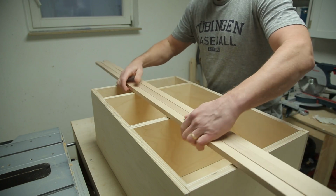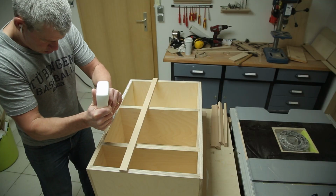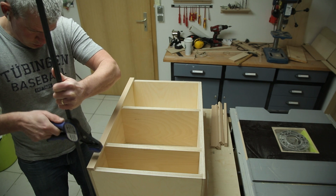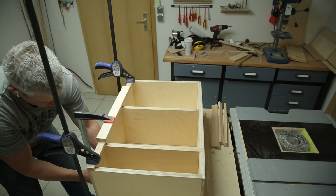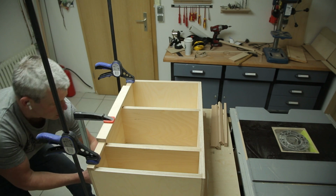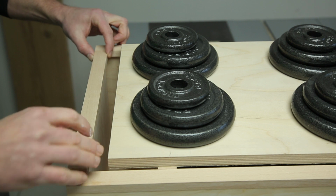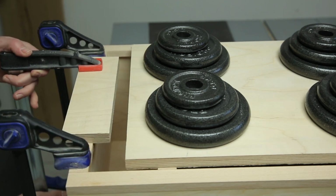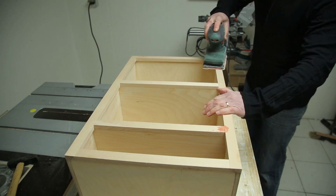I have some Beech left over from a previous project, so it's just a matter of cutting to length. Start with the 2 sides, or stiles, since they run the length of the cabinet. By just using glue and clamps, you can avoid filling any brad nail holes. Once those are dry, cut all 4 cross pieces, or rails, to a snug fit. The end pieces can be clamped, but weights will have to do for the middle ones. Sand flat, and flush cut the outside.